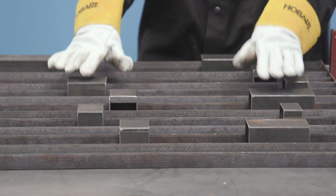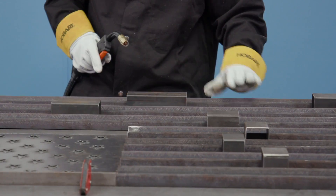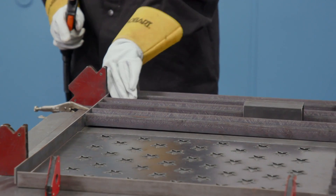You want to make sure these are tight so that you know they're not moving, and then you know you're squared up to them. Next step is to tack. So make sure you have your clamp down here, make sure everything's flush and everything lines up nicely, and then you're ready to tack.